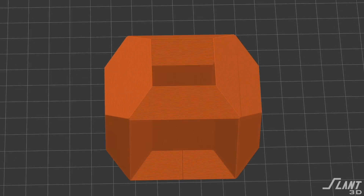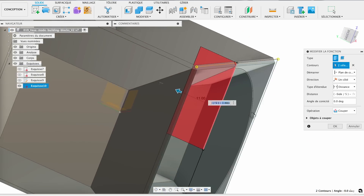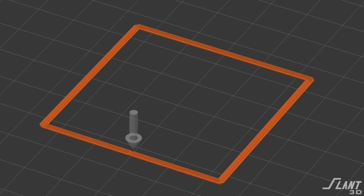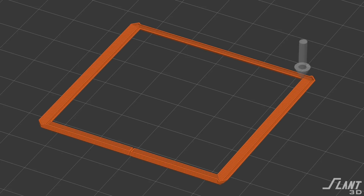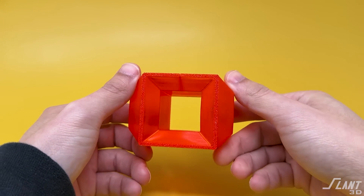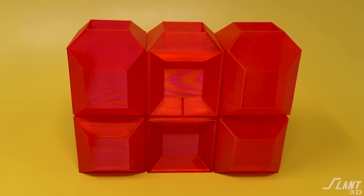It's printed on its side so that if you're looking top down you can see all the way through and you have these two outer edges. Each of these sides print out and you have a continuous loop. But at the top you have a situation where you can't do vase mode because you'd have a single thin wall which is fragile. So you have to do subtle things — you actually start cutting through the wall. We have a small slot up here so that this entire edge of the block is still one continuous outline. That allows us to create structure where multiple planes are interacting with each other so it doesn't just twist — it's not just a film folded together. It actually has structure.